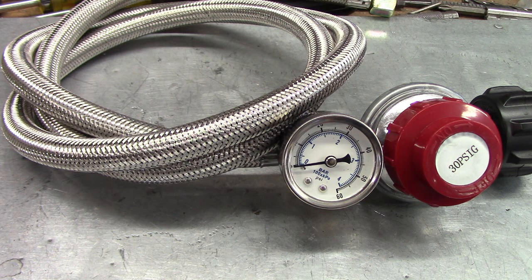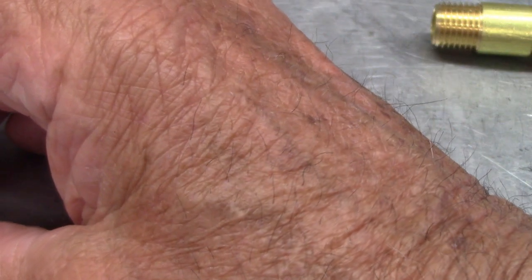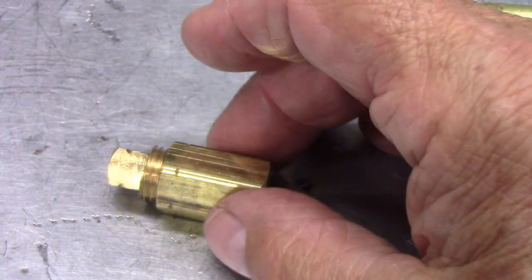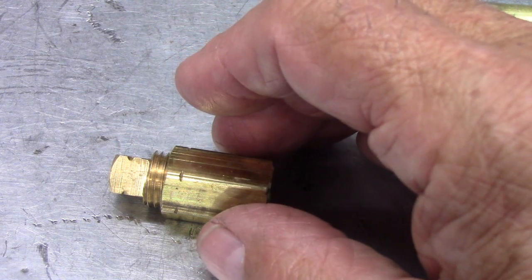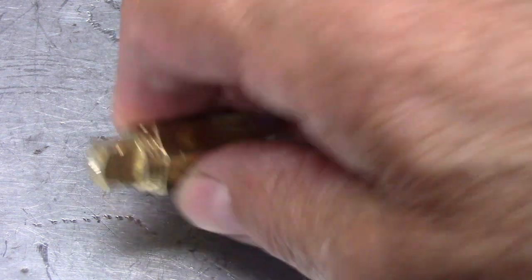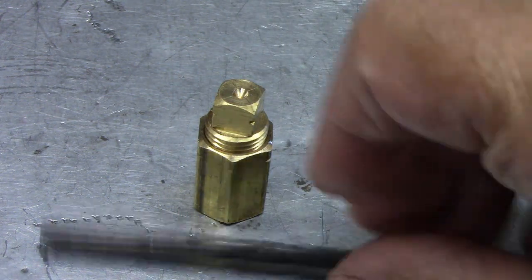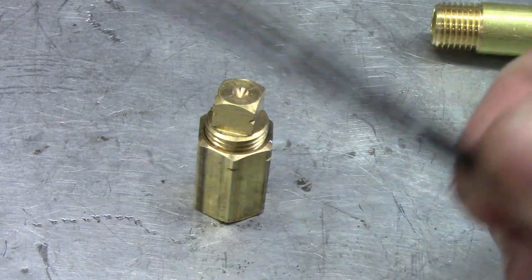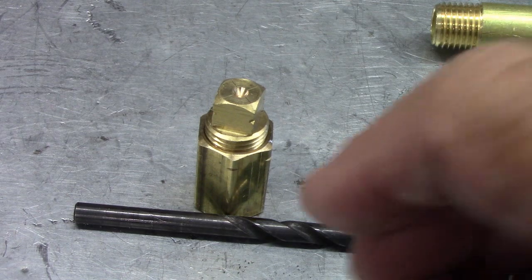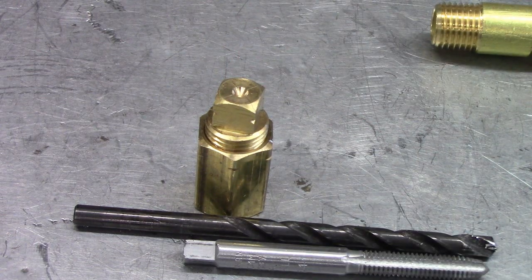So I guess the next thing to do is to drill out that cap in the lathe. We're going to take this off. This is a hex coupling, so that'll fit in my three-jaw chuck. I just have a little lathe, a little 7x14 - it's rather cheap but it does the job. We'll set up with this right in the lathe and the three-jaw chuck, and on the tail stock we'll take the drill bit and drill this out to 13-64ths. Then we'll take this guy and by hand we'll turn the chuck into this hole and thread it that way, so everything's perfectly straight and should tap straight.